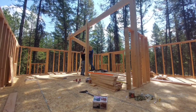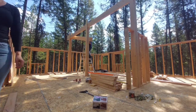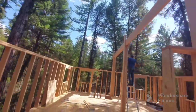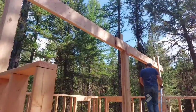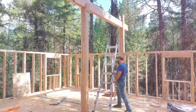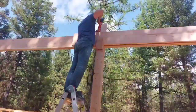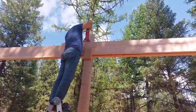This is the next day and we already have put up half of the beam, which means we have four pieces of lumber up. I forgot to mention that our beam is 30 feet long and we are hanging it at over 20 feet high — about 26 feet high, something like that. We opted for a build-up beam because we are living in a remote area and a prefabricated beam would be harder to transport.